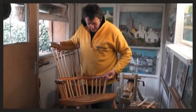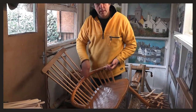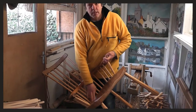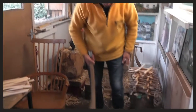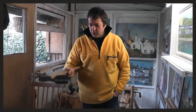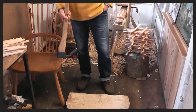This is one of my chairs that I made. It's made of an elm base, a yew tree branch which is steam bent, and it's got ash sticks. One of the most tricky bits is to cut out the seat and make it a nice shape that will fit your backside. This is one piece of sycamore that I'm going to make a big chair out of at a later stage, and I'll carve it out with this tool — it's called an adze. This is the sort of tool that shipwrights, chair makers, and house builders would use to do a substantial amount of their work. There is a bit of knack to this, and if your back feels sore, you stop.